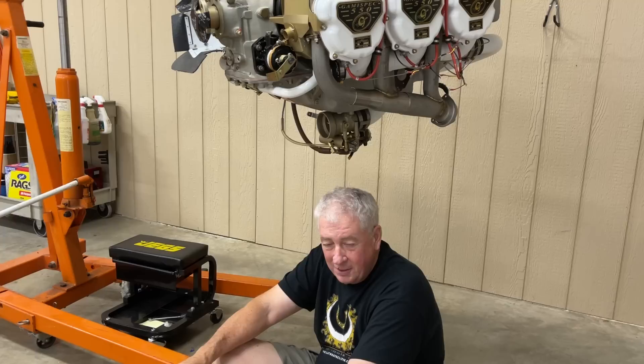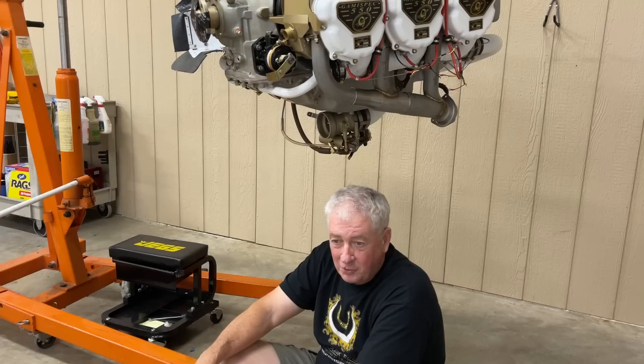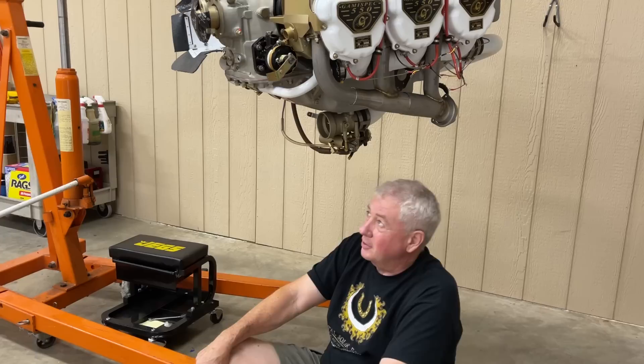What I ended up having to do is loosen everything up again and find a way to get those nuts on. I'll show you a couple of pictures. I had to get the nut on about halfway — it's a steel lock nut, so it wasn't really happy to do that — but I would get it about halfway and then I could get a socket on it and get it the rest of the way. The real trick is: get them on partially, work them up. Don't run one nut up snug, don't snug anything up until you're really close. There are four nuts per side, so that's 12 nuts total that you've got to work up individually. Otherwise you're screwed and you've got to do it all over again. I only did that a couple of times.